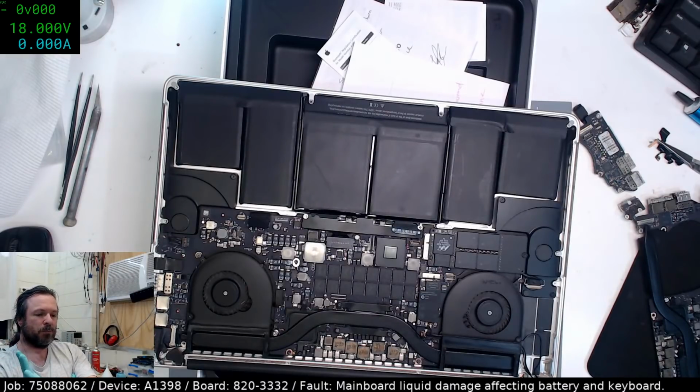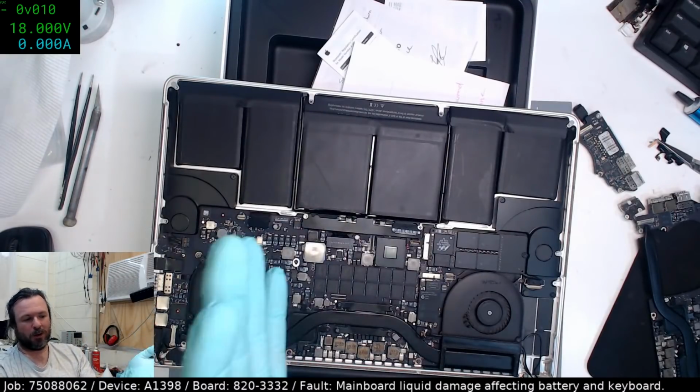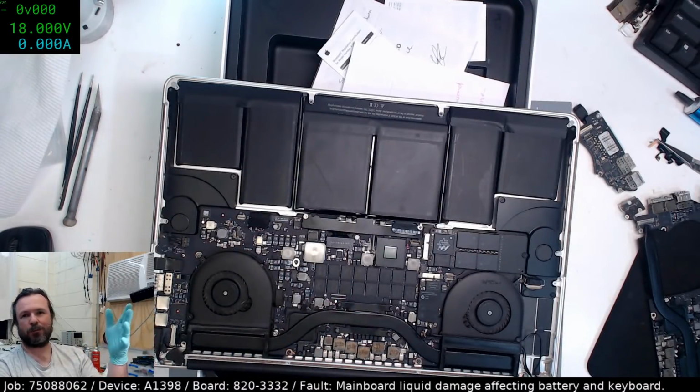Most lithium packs from about 2005 onwards were fine with 1C charge rates. And then by around 2010, 2012, we were starting to see 1.5 to 2C packs coming out. It's still better to do them at a slower rate, but at least with the newer packs, you can push them harder if you want to.